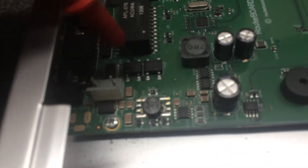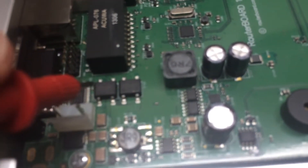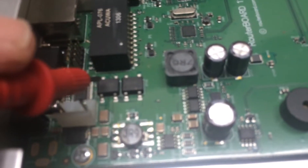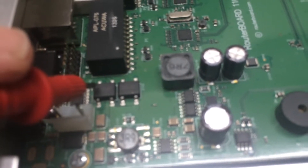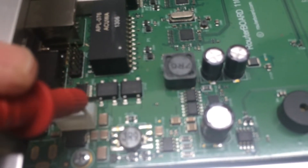So I started tracing the circuits out here in the power supply. This is the power supply that's normally connected to the city main. These are two bridge rectifiers that are fed from port 13 on the front. The reason they put two bridge rectifiers in instead of just a diode is that if somebody accidentally plugs in a crossover cable, you'd reverse-feed the Mikrotik — and they didn't want that. Whenever you hook a rectifier up to DC, all it does is ensure the output is correct.